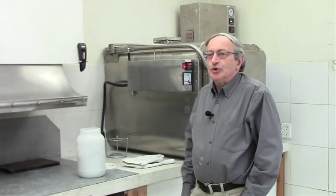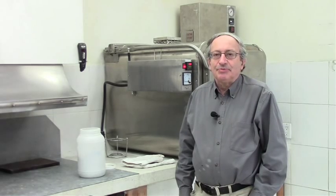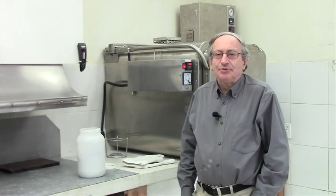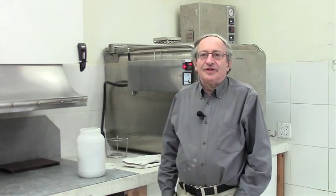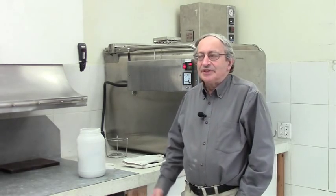So this is just a quick note on how to fix defects before painting. Sometimes you make a sheet metal enclosure and you get some dents in the sheet metal. Especially you get a lot of defects when you have to weld a larger enclosure, and you still have some dents left over from the welding. So the textbook solution is you buy a special high temperature patching compound which can tolerate the baking temperature of the paint, but it doesn't work very well, A, because it's weak, B, because it discolors the paint.